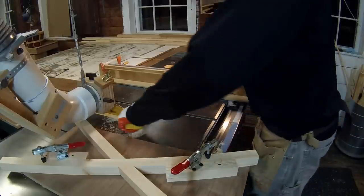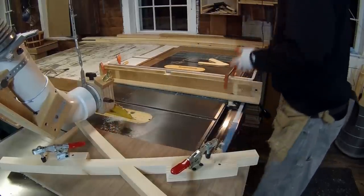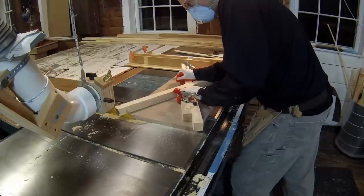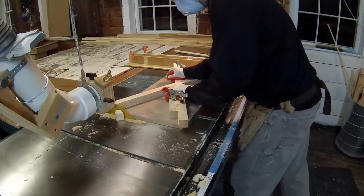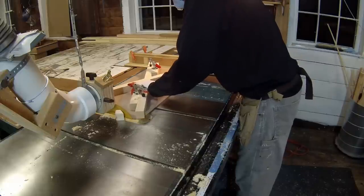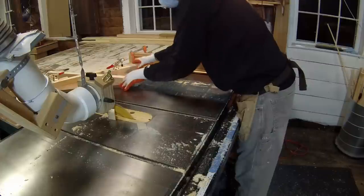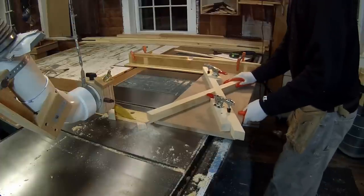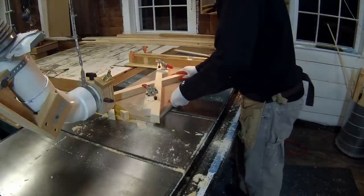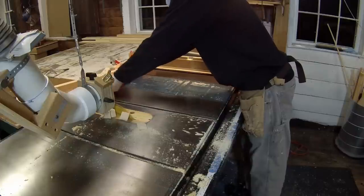I have a guide fence clamped onto my main fence with a thin piece of wood on the bottom that rides under the overlapping X, using the substrate as a template to match the outside dimensions of the X. There are multiple compound angle cuts to make the X, and doing it with a template makes it a lot simpler — I don't actually have to measure any precise angles or lengths, which are difficult to lay out. Making a template speeds up the operation and minimizes calculations. I just have to calculate the angle of the X when I cut the dado slots and the size of the template accurately, then line up the X centered on the template.